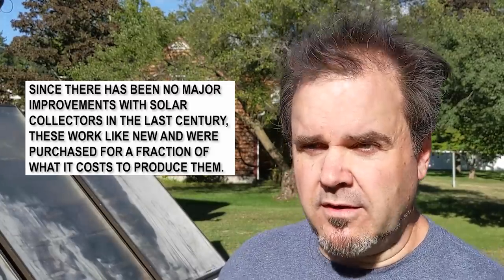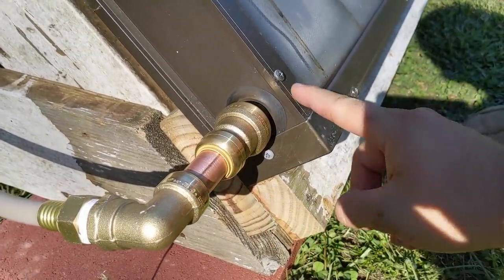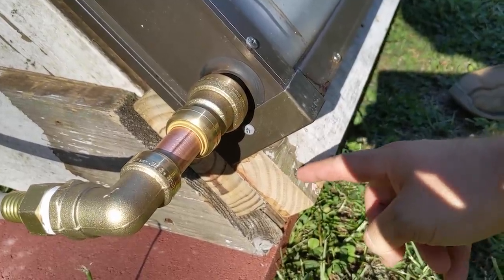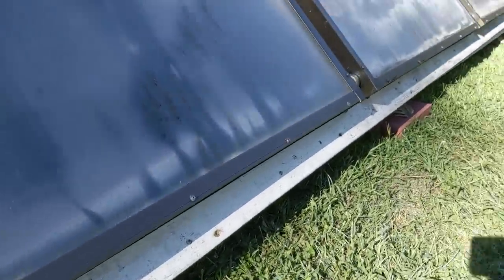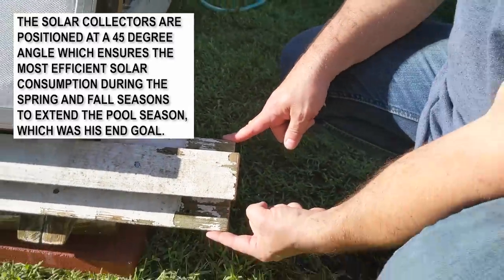Once you do it, you have a much clearer idea of what somebody was explaining. When you had described what I needed to do, I heard all the words, I understood it, but now having done it, it's night and day different. Back here we have a two-by-six going between the supports and that's what the panels are resting against. Then we have a two-by-three that I ripped, and we snapped a chalk line, and that creates a shelf.